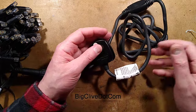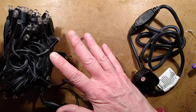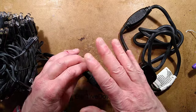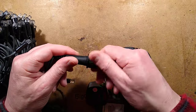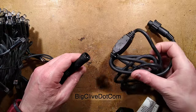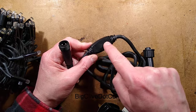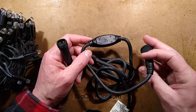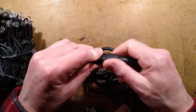Because these strings can be joined together, you can join 50 sets together — which is ridiculous, because it's typically 100 LEDs per set, so you're talking about 5,000 LEDs off just one cable, and even then it's only about 2 amps. When you get these you'll get loads of plugs and rectifiers, but you don't need them all because you join strings together off one rectifier. Keep the spare rectifiers, though, because the thing most likely to fail — apart from wind damage breaking the strings — is the rectifier. If anything gets damaged and short-circuits in your string it will blow the rectifier; it goes short circuit and just keeps blowing the fuse. Throw the spare rectifiers into a box because you will inevitably need them.